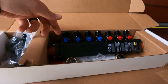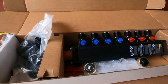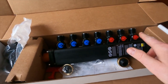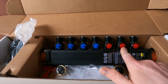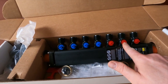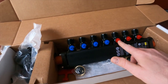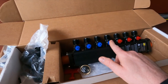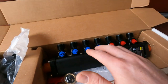You might be wondering, what's the purpose if you only have four cold and three hot? For me, I'm basically going to incorporate this by zone. I'll have one that feeds the kitchen — and that'll technically feed the dishwasher as well. Then another one that'll feed the main bathroom, which includes the vanity faucet, the shower, and the toilet. And then the last one will be for the washer dryer. Those are my three zones. Then they give you a fourth cold one, which I can use for the outdoor spray port.